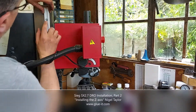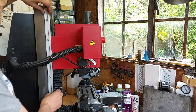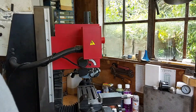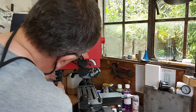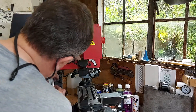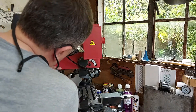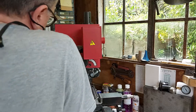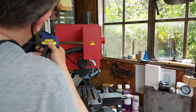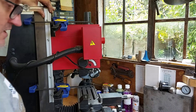I've drilled and tapped five M4 threads into the cast iron pillar. I'm going to put this track right on the edge of the cast iron pillar — it's absolutely aligned parallel. I'm going to put a plate on here and clamp that in place so I've got a hard plate to work to and I can push it over. Same one here — piece of plate, clamp it to the cast iron, and then you can see it just moves over.